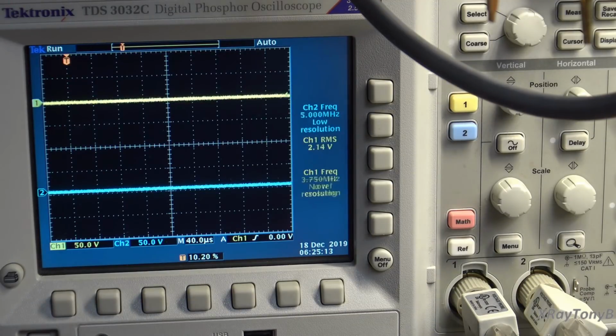I have not put the distortion meter on it yet, although I do think this amp has just a little bit of distortion. I think there is a very slight crossover distortion being generated, not in the output section, but somewhere around the driver section. I'm going to have to look into it. Maybe not, I don't know. Maybe it's supposed to be that way. But the output looks very clean, as you could see. It was extremely clean. So I would say this amp's working.